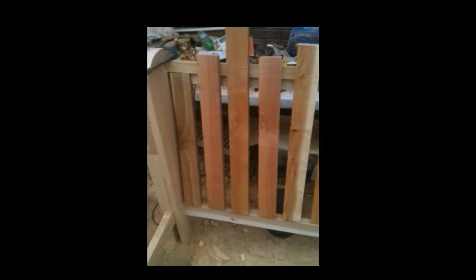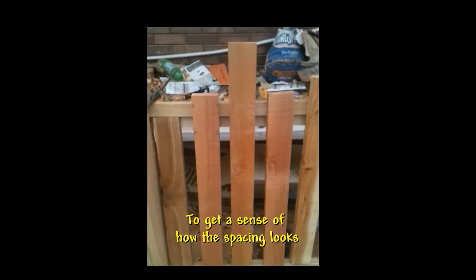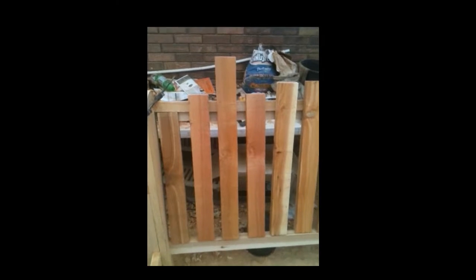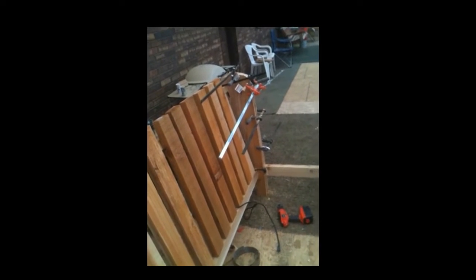All these backboards are in now. The two on the end are cut to the right size — you can see they kind of recess back in there. The others in the middle are just rough cut now just to get a size, and you can see they're all different sizes going across the top. What we're going to do now is cut them exactly the right size, put a bevel in the bottom so they meet that rail just right, cut a groove so they go in the slot just right, then plane them down, smooth them, and install them.